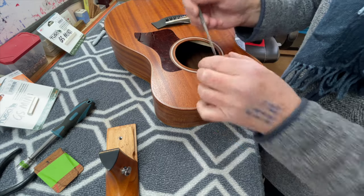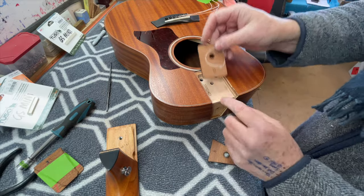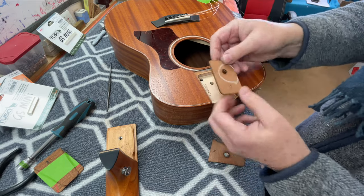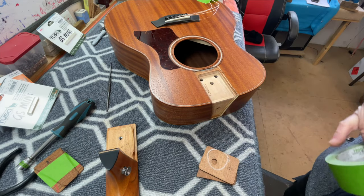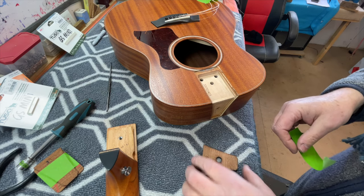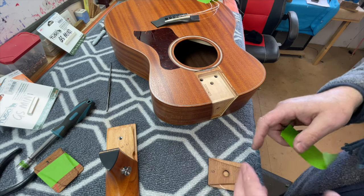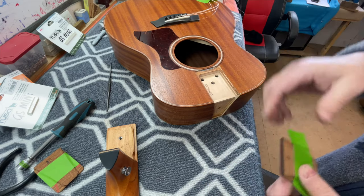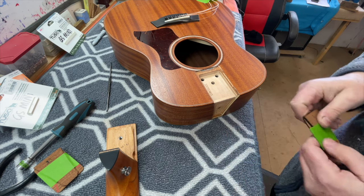By the way, if you get some of the replacement shims, these often don't quite fit in there. What you have to do is run them on a flat sanding block until they do, but do a stroke on each end so that they're moving the same amount. It never requires a huge amount, but you definitely want to be very careful. Use the minimal amount of sanding, because you're changing the length of the shim, and you don't want to be cutting into that. I've had it happen a couple of times, but like I say, a couple of runs on a flat block and it's done.